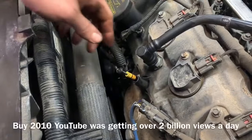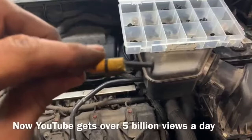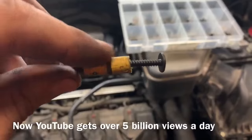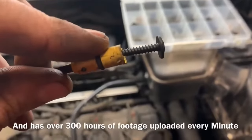If you're unable to pull that out with your hand, you can always grab a pair of pliers and pull it out that way. What I don't want is the screw in there all kittywampus, so I'm going to end up taking that back out, drilling a small pilot hole smaller than my screw, and screwing my screw down to the base as much as I can.